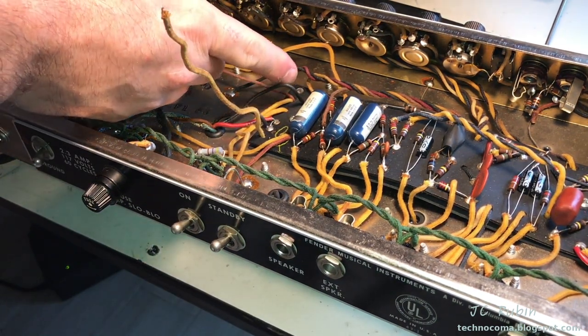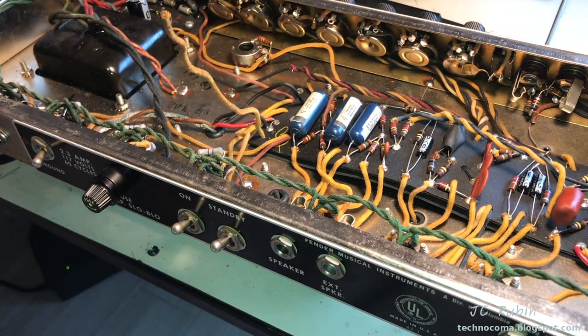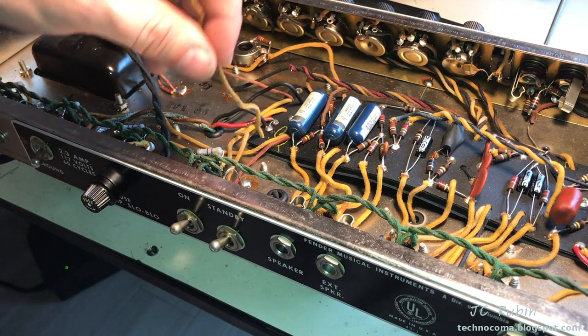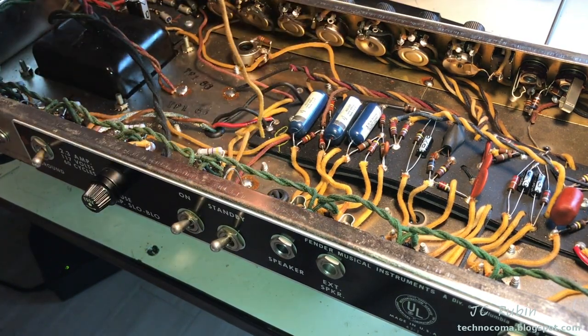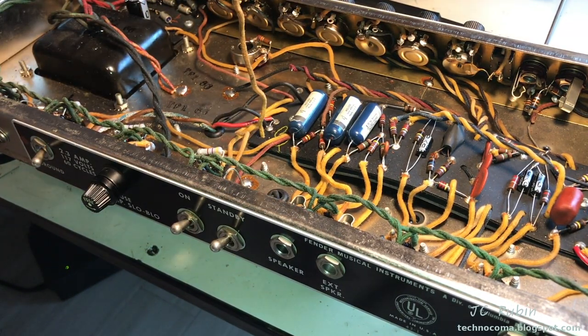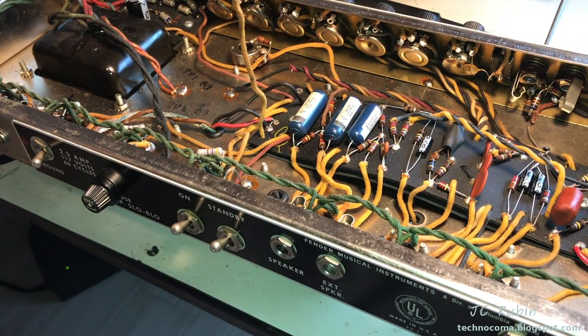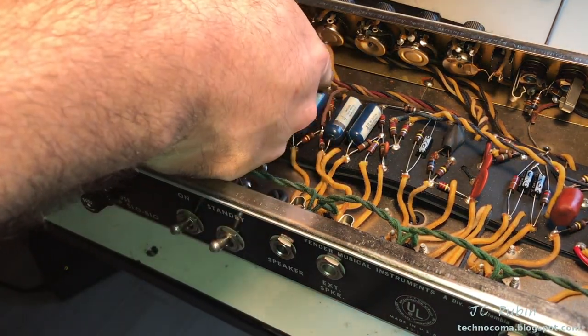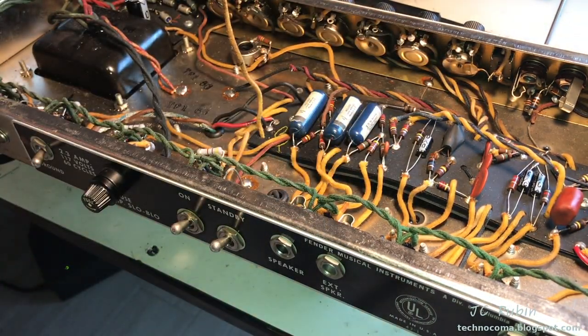And that's it, that's all I did. I've raised this red wire. None of the rectified DC goes out to that filter. I still have this removed. I'm going to repeat my test. And I'm going to see, now that there's no filtration up top, if there's still a short, if it clears up, I'm going to start following these wires back up and see what's going on.